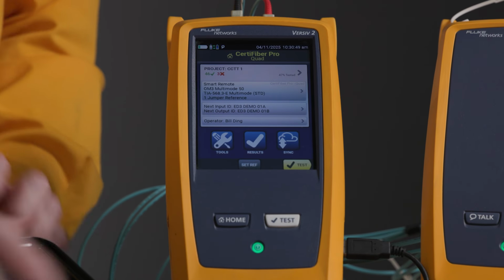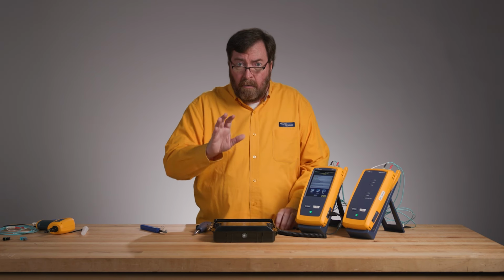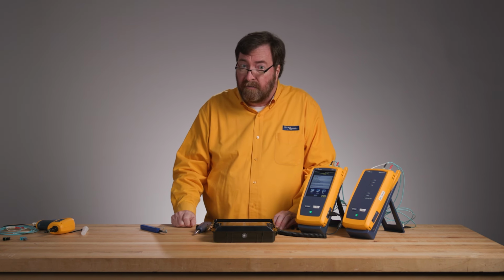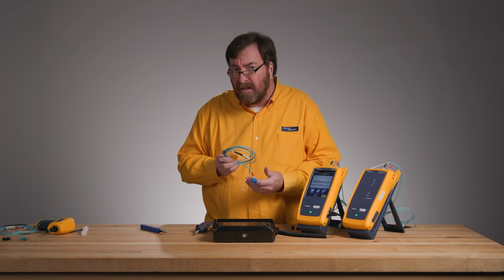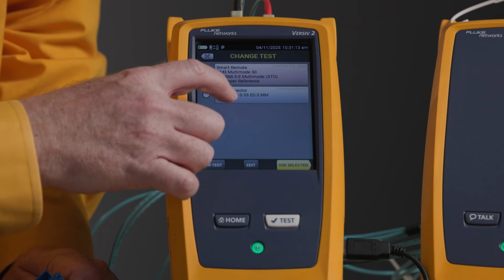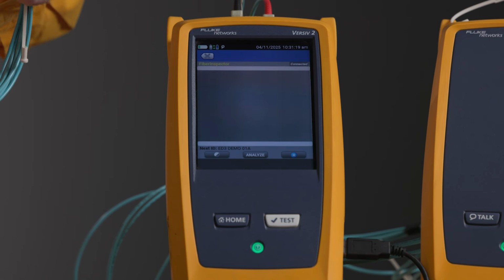Okay, normally I just use this demonstration box. The demonstration box just happens to have two 50-meter pieces of fiber. But we wanted to talk about a specific aspect of the new 61300-3-35 standard, edition 3, and that is what happens if there is a fiber that I can't get clean. So I'm going to switch over to my fiber inspection test again. We'll use selected, we'll push test to start, and we're going to inspect this fiber.